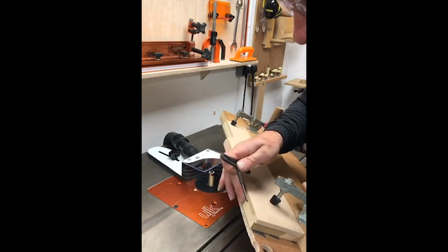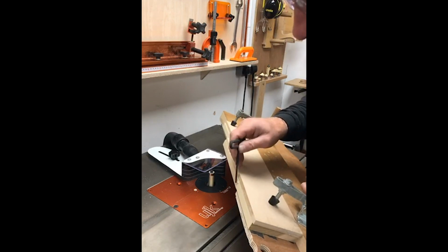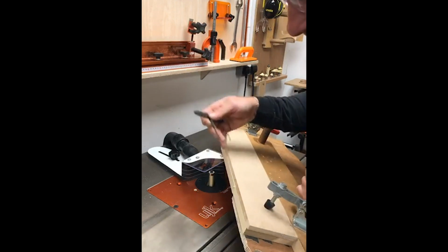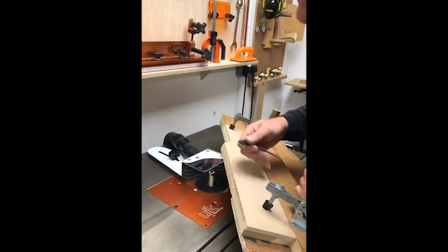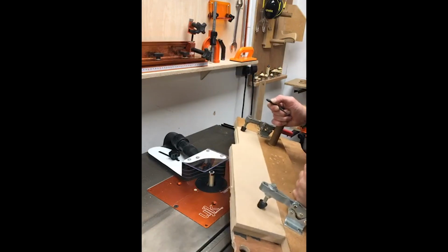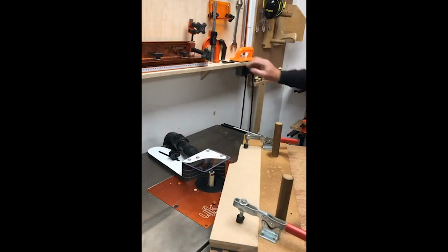Really clean, a planed finish. And that's the amount of material that's removed. So there's no splits, no risk of splits and chipping. Really forgiving on the cutter, the router, and you as an operator. You haven't got to force it through because it's trimming, not a complete severance cut.